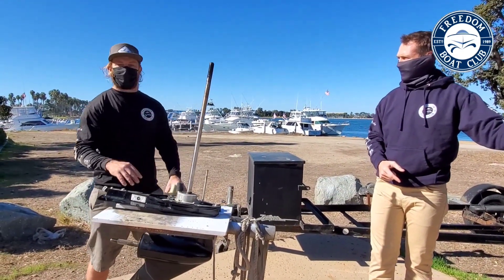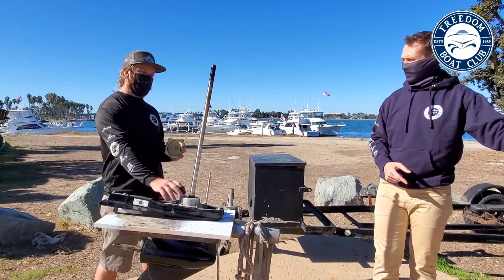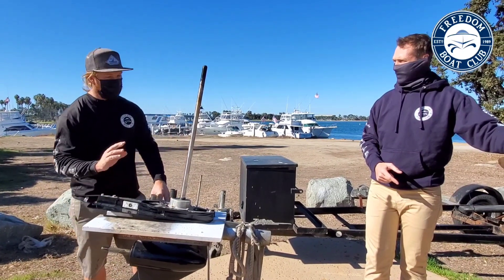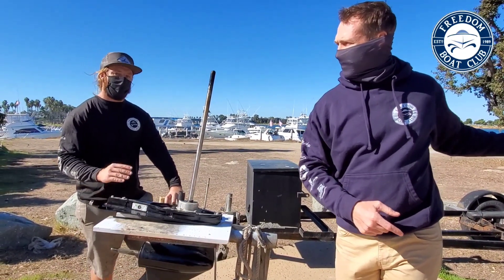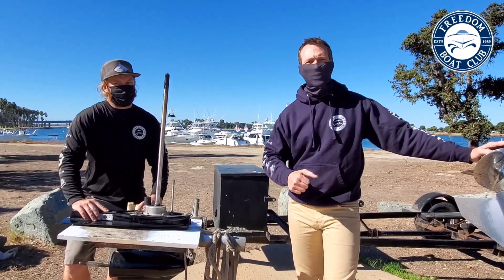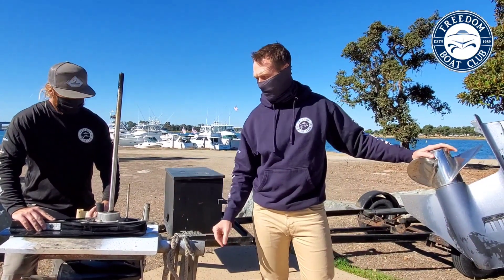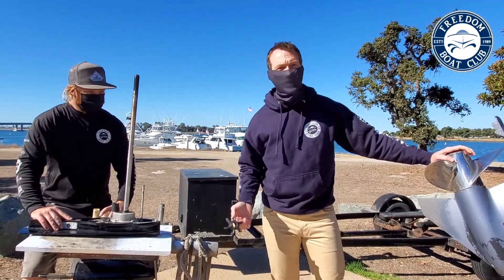Sometimes obstructions that get sucked into the intake can stay inside the propeller or the housing, so the obstruction could remain there longer than needed. Wait for it to cool back down to temperature, then proceed with your trip. This is a really important point when beaching a pontoon — you don't want to suck up sand into the impeller. It actually destroys the impeller, essentially turns it into sandpaper, and that ruins your day too.